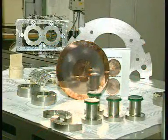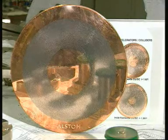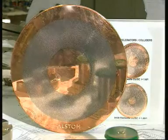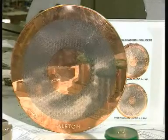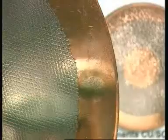Among the parts of this complex machine, the superconducting cable constitutes a real object of curiosity. Here's a life-size cross-section of the cable as it starts off: a 25 cm diameter, 80 cm long copper cylinder, inside which 9,000 hexagonal niobium-titanium bars have been placed.